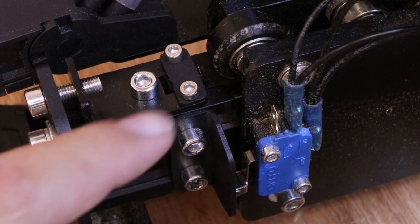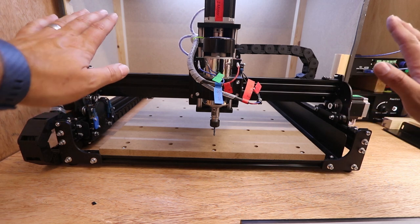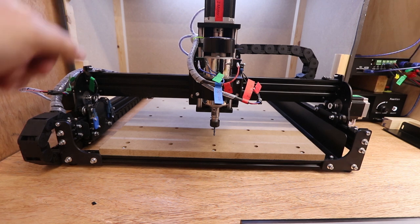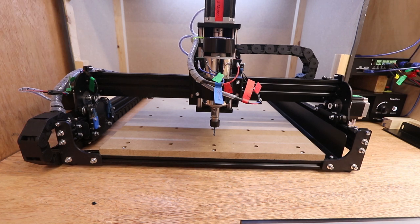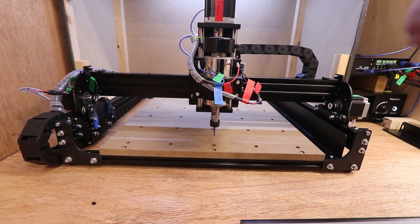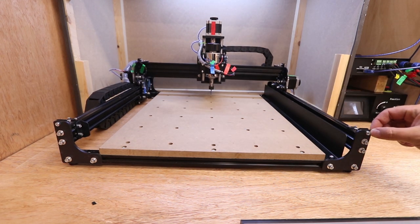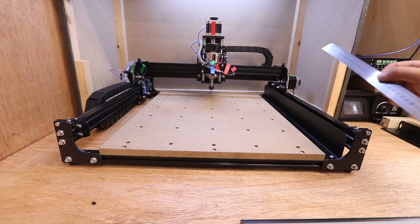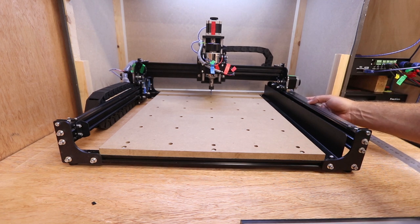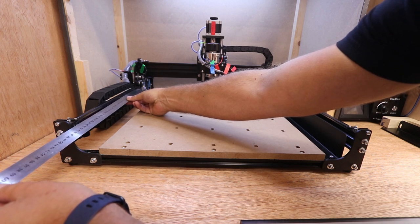Do check the bracket at the other end as well — you don't want the wheel hitting the bracket before the limit switch. For the final test, we've got a set measurement for both sides of the axis. We set the X-axis back a designated amount and re-measure the distance — they should be exactly the same, just as a final check. The machine is fired up and using a piece of wood I check the initial measurement on each side. After sending the axis back a couple of hundred millimeters, I measure from the front bracket to the plate: 454.5 millimeters on both sides. Perfect — we've installed the belt, checked the tension, and confirmed everything is running accurately.